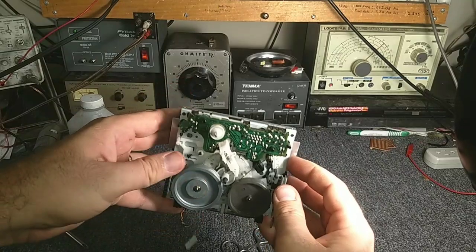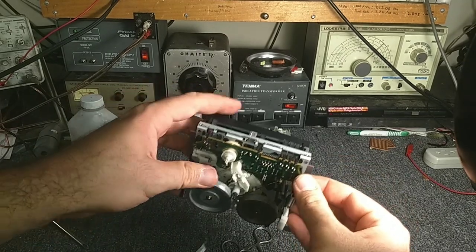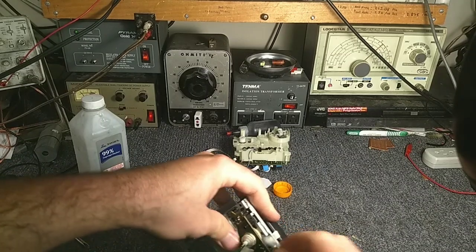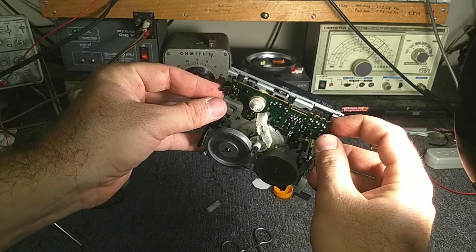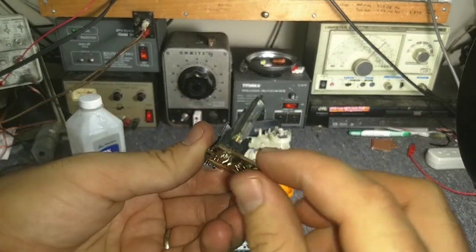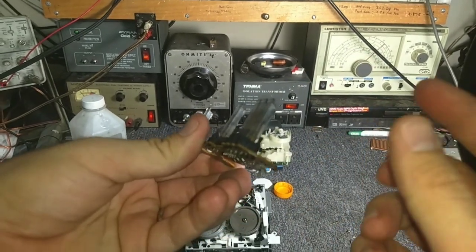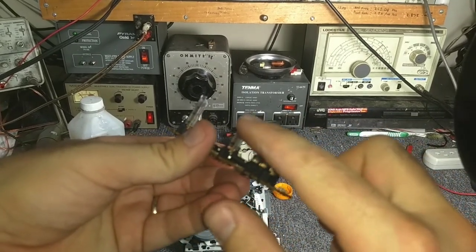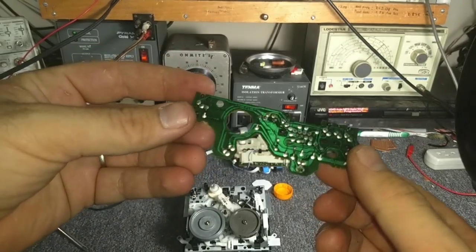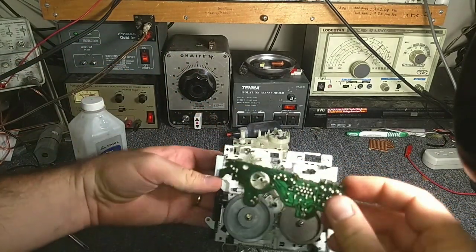On a very rare occasion, the detect switches up here get touchy and need to be cleaned. There are two clips on the side - pull them away very gently and the entire switch assembly separates. You can see the little nipples on the sides - apply very gentle pressure with a jeweler's screwdriver underneath and pull the caps off. Using emery paper like 3,000 or 4,000 grit, you can burnish the switches. But it's very rare that these ever go bad - maybe one deck in ten years.